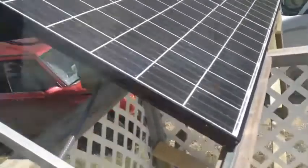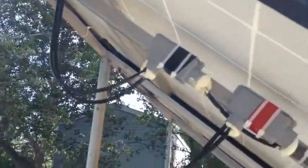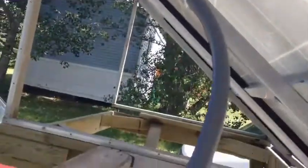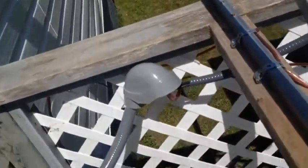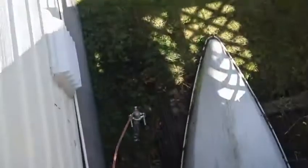I've got them bussed together into two little junctions underneath here — red positive and black negative — and thereby I was able to keep the voltage below the level required by the pulse charger. I've got a nice grounding here to a good galvanized ground rod that goes about six feet into the ground.